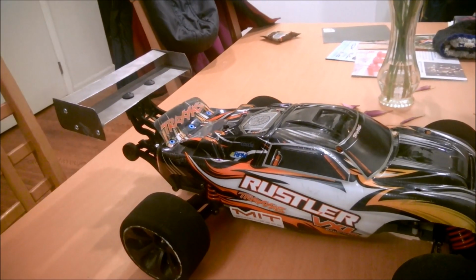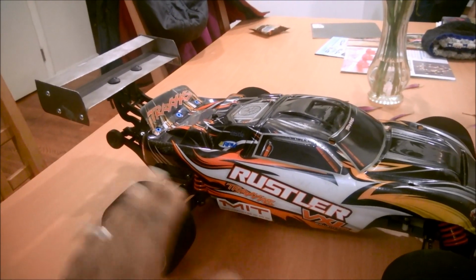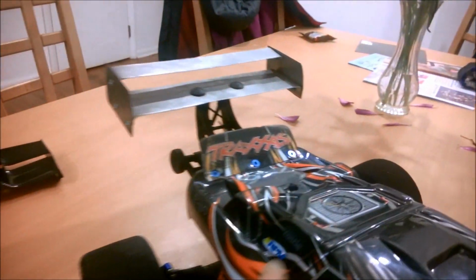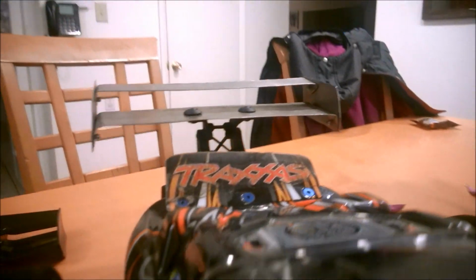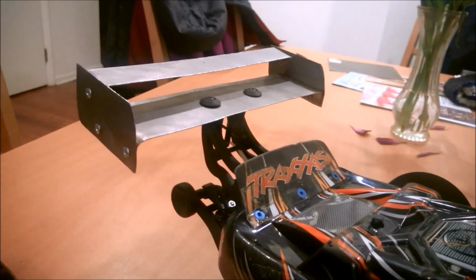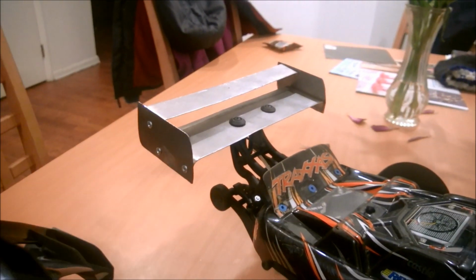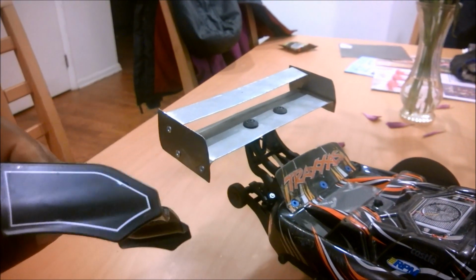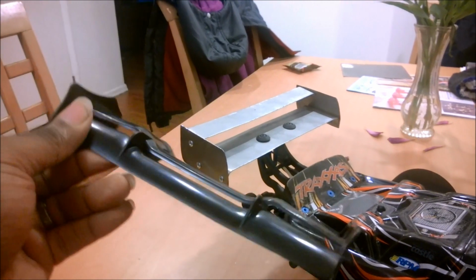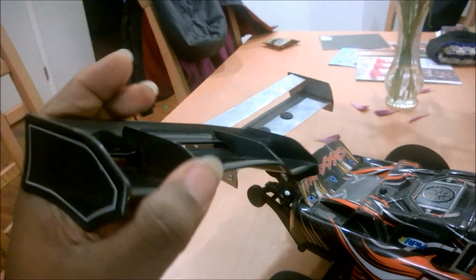So I concluded that I probably don't need the downforce that's coming out of the rear, but I do still need the directional stability. So that brings us up to my new spoiler. This guy right here, if you look straight on, is made out of sheet metal. He's flat. Now, for those of you who are familiar with my friend Bernoulli and the Bernoulli principle, airfoils generate lift, and I talked about this in Aerodynamics 101, by basically curving airflow around a curved object. And if you look at this spoiler, you see it has some significant curves. That's called camber. So this is a highly cambered wing.